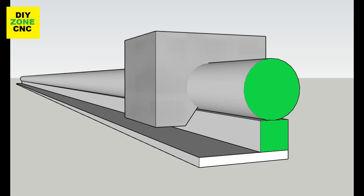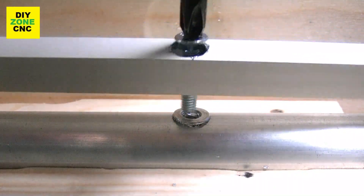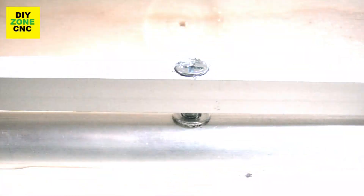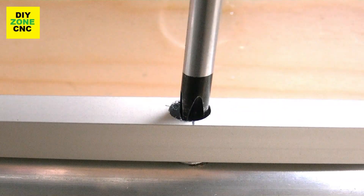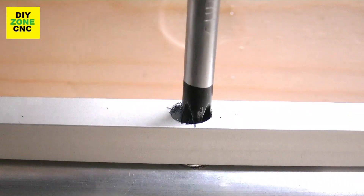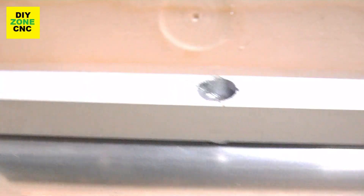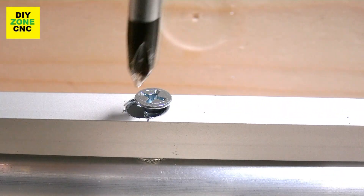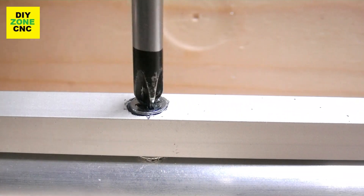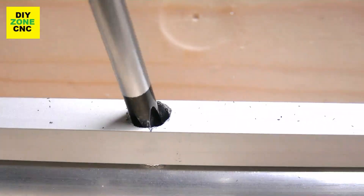We are now able to connect both tubes. The round tube is placed in a fixture. The M4 20mm screw that will connect both tubes will not be tightened 100% at this moment. You will notice that the bigger hole was not always aligned correctly, but this is not a big issue as the screw will go back to the rivnut's position immediately after the head went through the hole. Once all the screws are mounted, I will first tighten every fifth screw, then every third and so on. This method contributes to a better end result as there is less chance for unacceptable deviations.